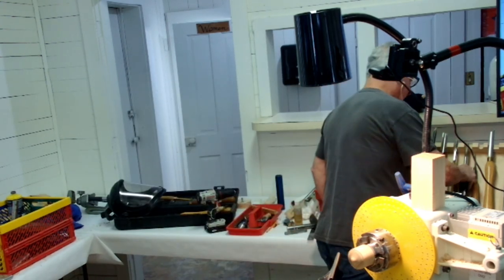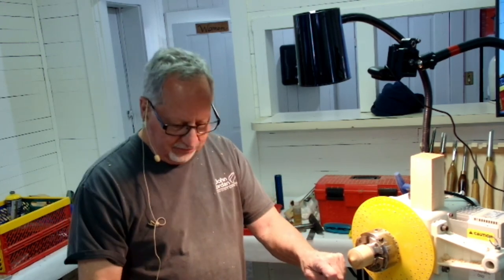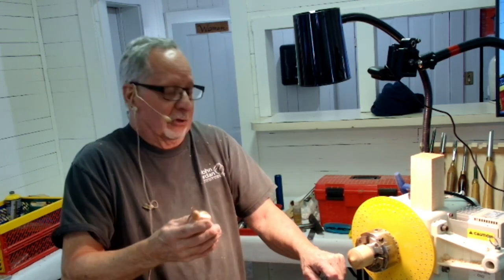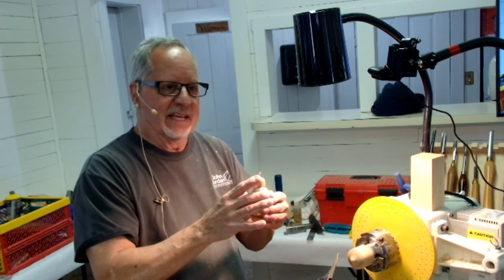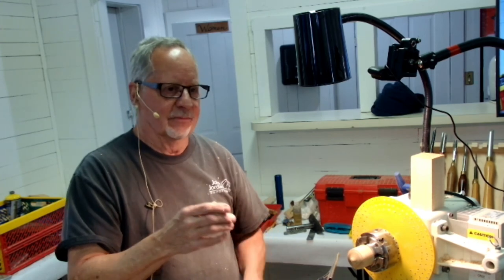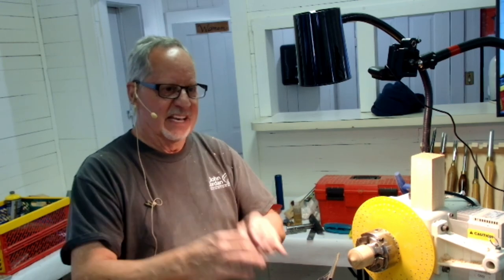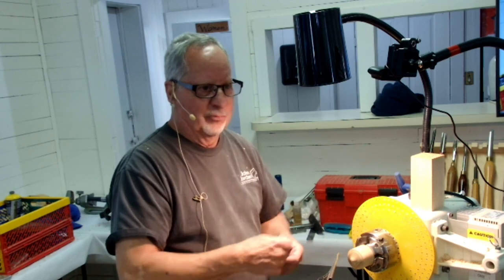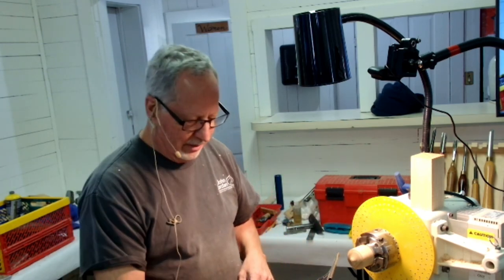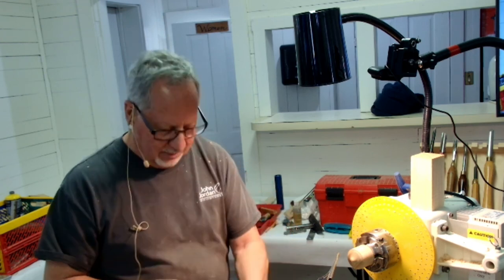It's with copper and brass and aluminum. Do you grease the surface? Yeah, you got to grease the surface. I use Dove soap. Works pretty good. It work hardens, and it won't bend anymore without breaking. So you have to heat it up red hot and then quench it. It's exactly like you would harden steel, but it anneals this. And then you put it in an acid to kind of clean it off because the fire changes all the colors, and then you go back and you hopefully finish your project on the next pass. Something that small you can do without work hardening it, probably, if you've done it right. But it's a cool process.